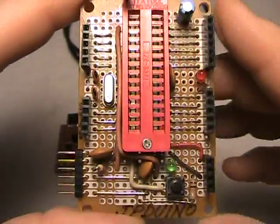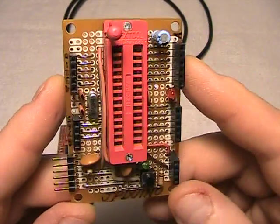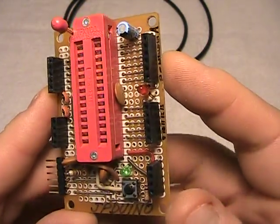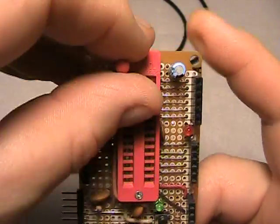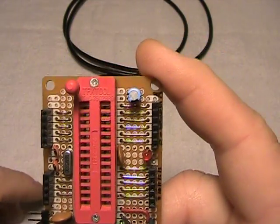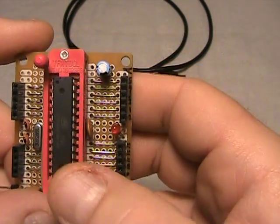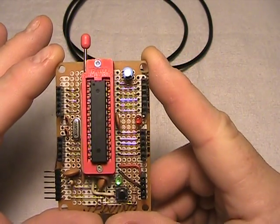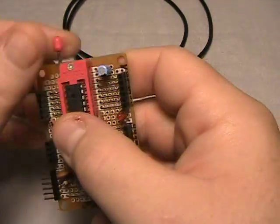My whole point of building this board was making myself something that would easily allow me to program the Atmel 168 or Atmel 328 chips. The concept was to have a ZIF socket for easy insertion and removal of the chip. So once I've got a sketch nailed down, debugged, and bulletproof, I would throw in an Atmel 328, for example, and close the cam lock.